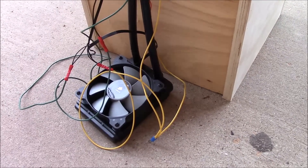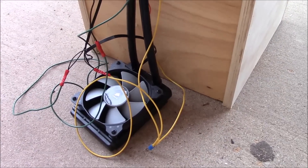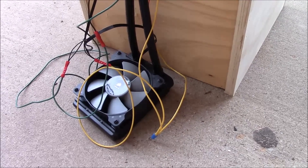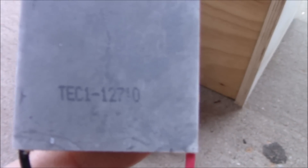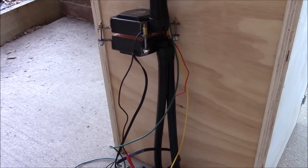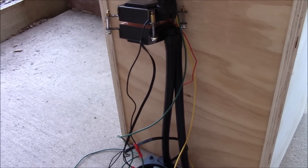What's up YouTube, this is LDS Reliance. I'm going to start shooting this fourth installment of the liquid cooled Peltier fridge series. Yesterday left a bad taste in my mouth, so I've got the fridge here again and I dug up a 10 amp Peltier unit — the TEC1-12710 — which means it's a 10 amp unit. I'm going to swap it in and fire up the fridge to see what double the power gets us before I order a 15 or 20 amp unit.